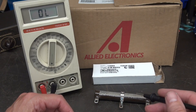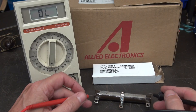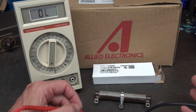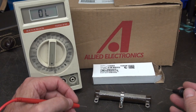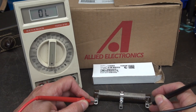So I have a story about these resistors. These are the 20K 50-watt resistors that I purchased for the Viking 2, and I always buy them in pairs so I have a backup since I'm always working on these transmitters. Here is the new resistor right out of the box. Before putting it in the transmitter I'm going to check it. I'm going to the outside terminals on the 200K scale, and you'd expect to see 20K — but it's open.